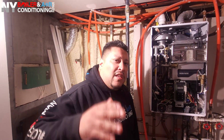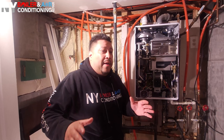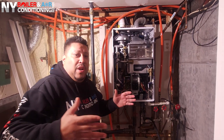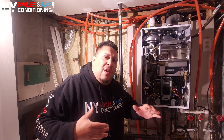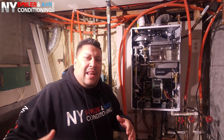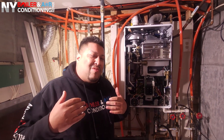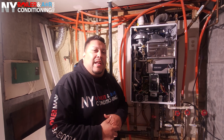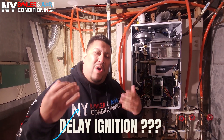Alright Mijente, remember what I told you guys about how important it is to do maintenance — it's very important, and I'm going to tell you why. In this particular job, a buddy of mine named Octavio — big shout out to Octavio — told me his boiler was acting up, making noise, like somebody was hitting the door. He thought it was plumbing because somebody gave him the wrong information, and he thought he needed an expansion tank and a few other things. When he told me, I said I don't think it's that, let's go check it out. Sure enough, what I found was something called delay ignition.